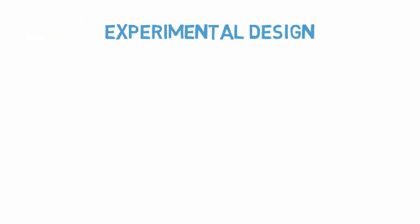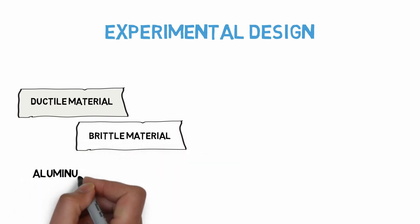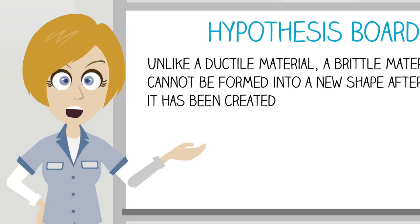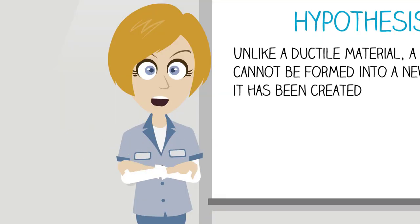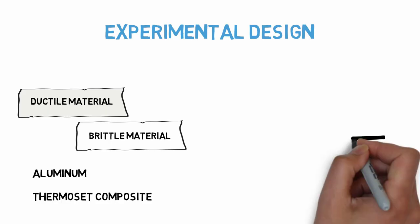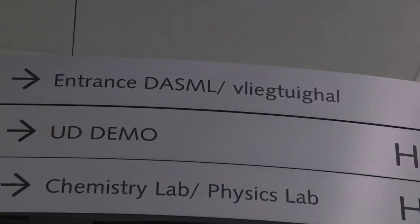Now that we have our hypothesis, let's define our experiment. Our experimental design is pretty straightforward this time. We'll need two sheets of material — one brittle and one ductile. Metal is the natural choice for the ductile material, and let's use a thermoset composite sheet for our brittle sample. Since we're using engineering materials, we don't expect you to have these on hand at home — we'll use them to perform our experiment, but we'll have a do-it-yourself suggestion later. To deform the materials, it's probably easiest to try and bend them out of shape. We'll use a special machine called a brake to help us out. The brake works by clamping down on the sheet, while a larger plate hinges upwards to bend the sheet up to 90 degrees, thus deforming the material. So now that we have our experimental design, let's head over to the Delft Aerospace Structures and Materials Lab to see this experiment in action.